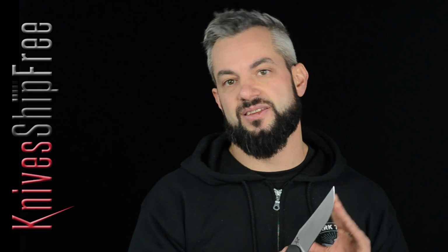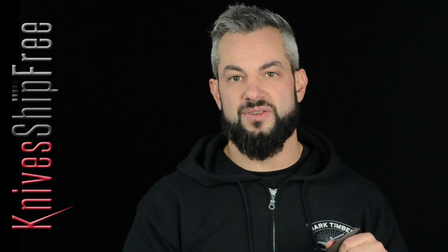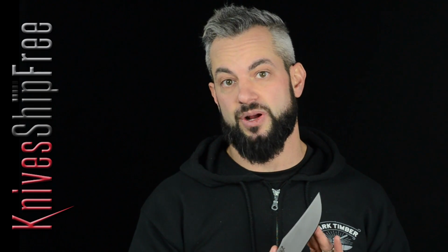With the 1911 Elite, I chose 5/32 3V. I wanted it to be thin and lightweight, but by choosing that 3V, we have excellent toughness, good edge retention, and wear resistance. I went with a bead blast finish. A lot of times in a custom knife, you'll get guys that have a closet queen. They don't want to get out and use them. I felt that the bead blast finish would help to encourage people to take these out and really use what I feel is a trail ready knife.